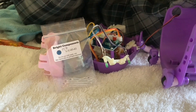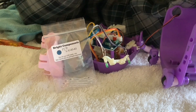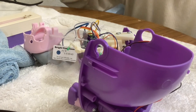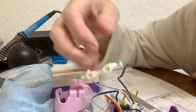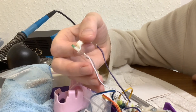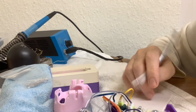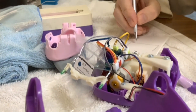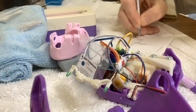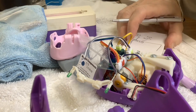With the purple hedgehog disassembled, we'll be using the blue LEDs first and replacing the green ones. The first thing Paul is going to do is make a note of the connections — the two wires going to the LED bracket need to be unplugged from the circuit board to make it easier to work on. Before doing that, he's making a note of where the connections go so they don't get put back the wrong way. That's purple and gray wire, and the second is white and gray.